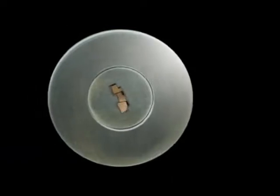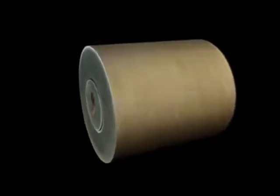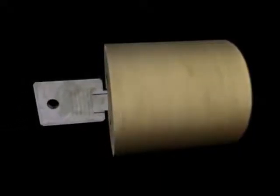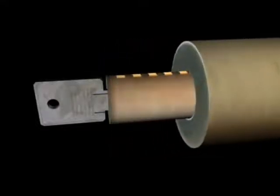Chapter 4, Wafer Locks, How They Work and How to Pick Them. The wafer lock is very common in many low-cost applications since they are much cheaper to manufacture. They can be found everywhere, including desks, filing cabinets, doors, windows, security boxes, etc. They are very similar to pin tumblers, except they use wafers instead of pins. The easiest way to identify one is by noticing the flat wafer in the keyway in place of a round pin. Picking them is almost identical and usually much easier.